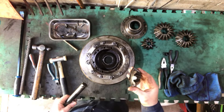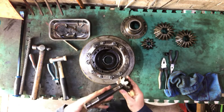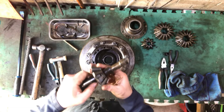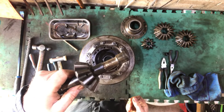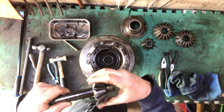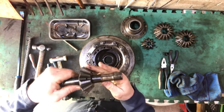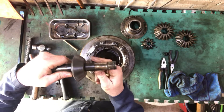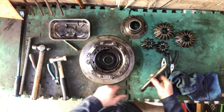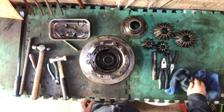I would have expected the middles to be out of them and everything, but they're not. Where that shaft is not worn, they fit nicely - they fit like a dog's lug. So shaft required, absolutely definitely. We could also whizz this crown wheel off - let's have a look in here.